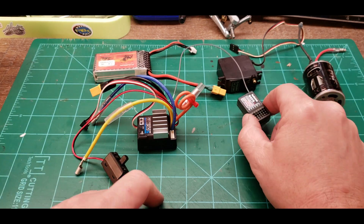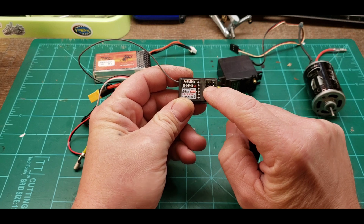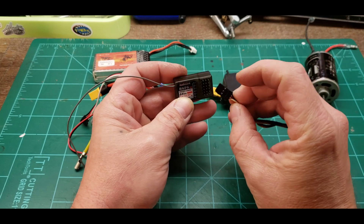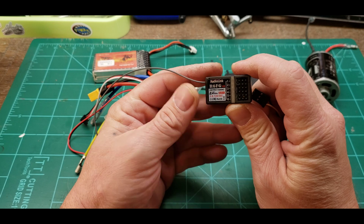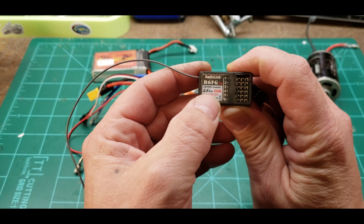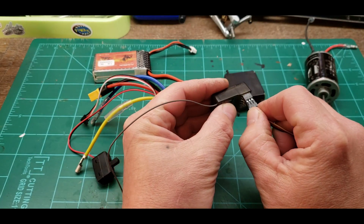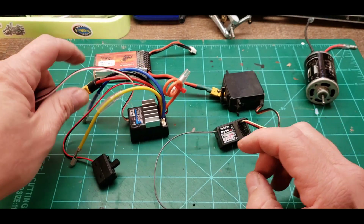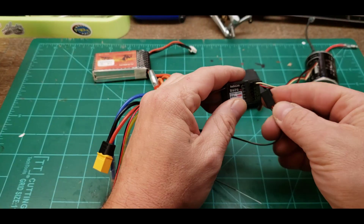The easiest way I've ever been able to remember this: one to turn, two to burn. You want to put your steering servo into slot one. If you look at almost every receiver, somewhere on it will indicate what's hot and what's negative. Right there it shows negatives towards the back, hot towards the front. Plug that into your number one slot, then take your ESC — which connects to your motor — and plug that into your number two slot.